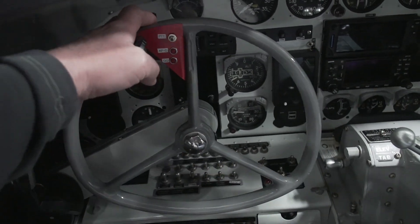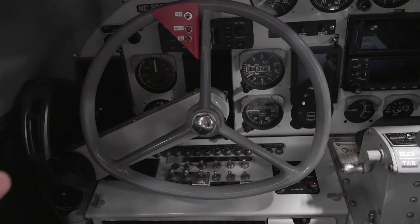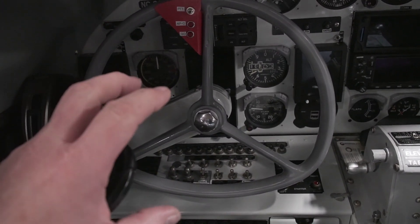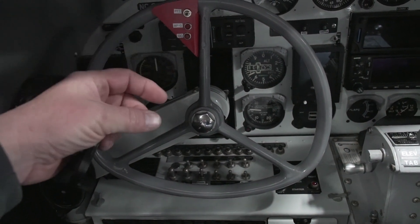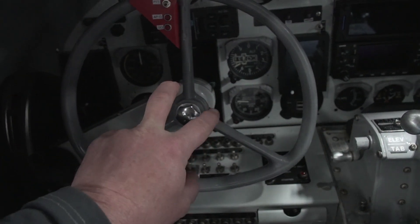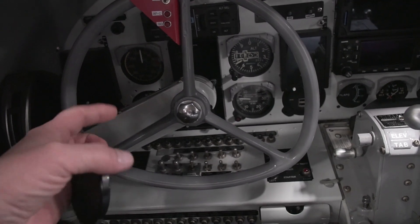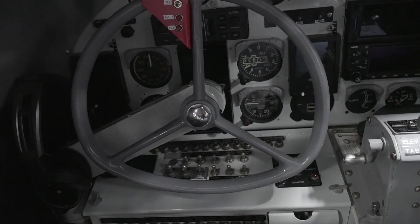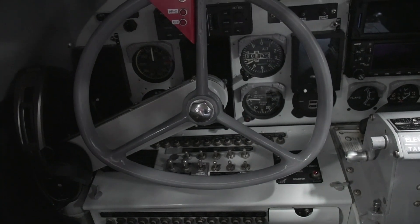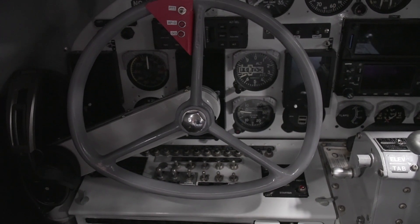What I'm trying to do now: when this airplane was originally purchased back in the '80s, I noticed from pictures that it actually had Beech 18 yokes in it. The Beech 18 yokes are a lot smaller than either one of these, so I am looking at putting the Beech 18 yokes back in. I'm having to manufacture an adapter because this has a straight-through bolt with a shear pin, and the Beech 18 just has three bolts that bolt onto the system. I'm making up a plate, and before I actually make it I'm putting it into a CAD system and working out the thickness and size of everything to make sure it all lines up before we put it in the airplane.